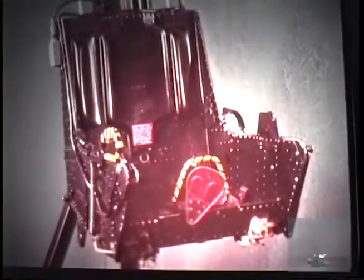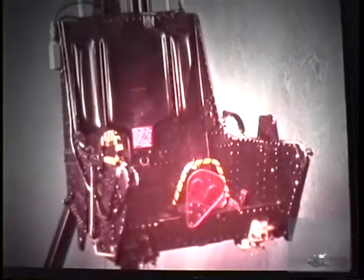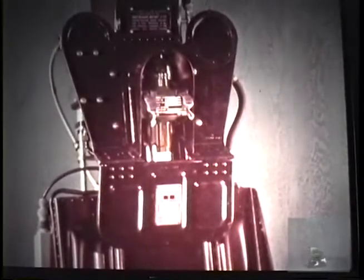The seat bucket supports the pilot and contains his survival pack. Mounted on the seat bucket are various control handles and linkages which operate the seat. The gas-powered inertia reel locks the occupant snugly in the seat during ejection or when excessive G-forces are encountered. The personnel parachute support arch is bolted to the main beam above the seat bucket. The personnel parachute is mounted here, and the assembly provides a firm support for the pilot during ejection.